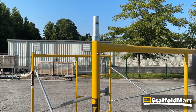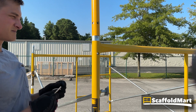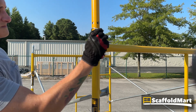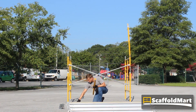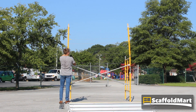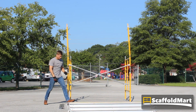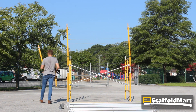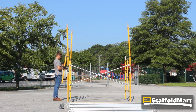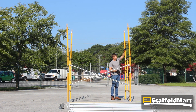The stack pins are where we mount our safety poles, which hold the safety rails, allowing us to build a five-by-seven guard rail around the platform at the top of the unit. These are held in place with a pigtail — a very common fastener in frame and brace scaffolding. Place one safety pole on all four corners, making sure the studs — the horizontal tabs about midway up the pole — are facing inward, pointing towards one another.